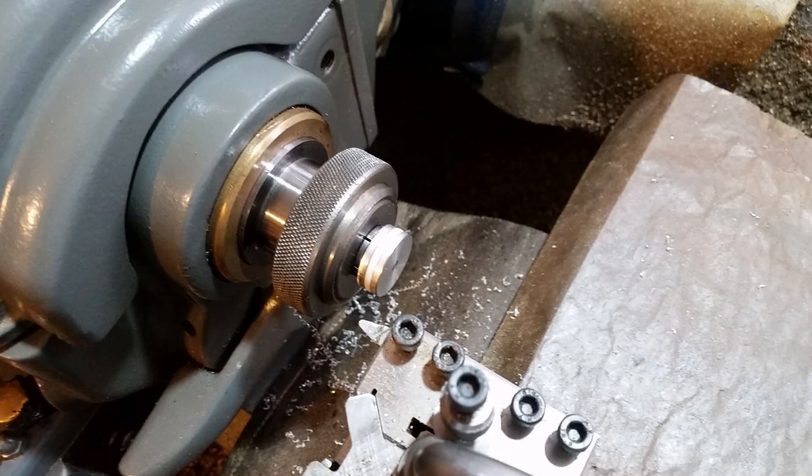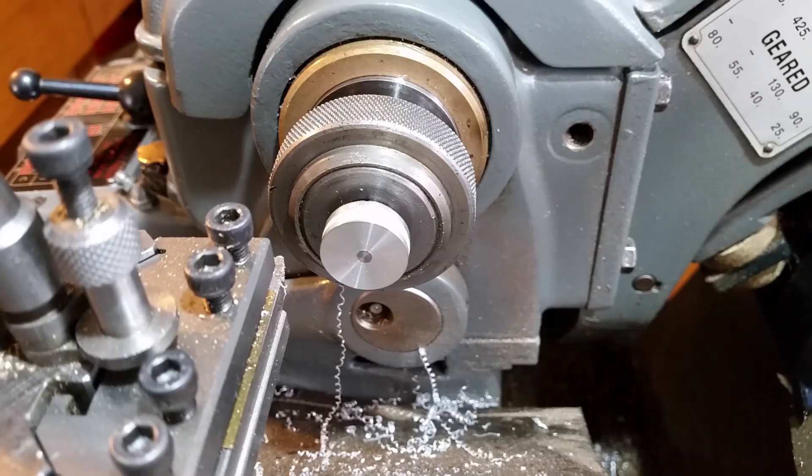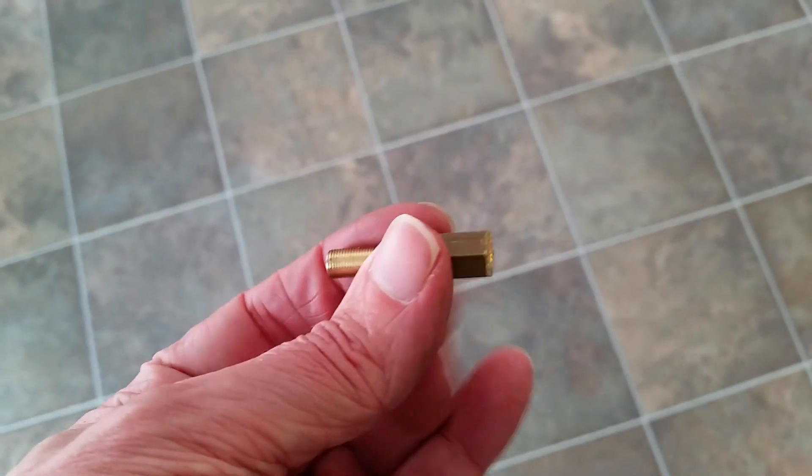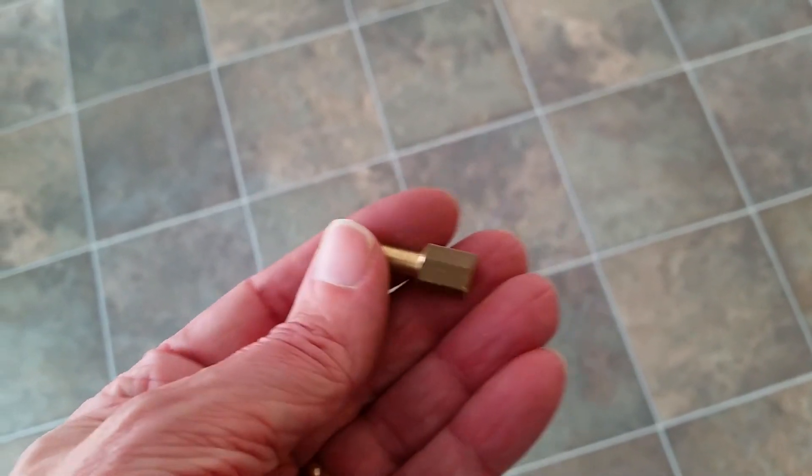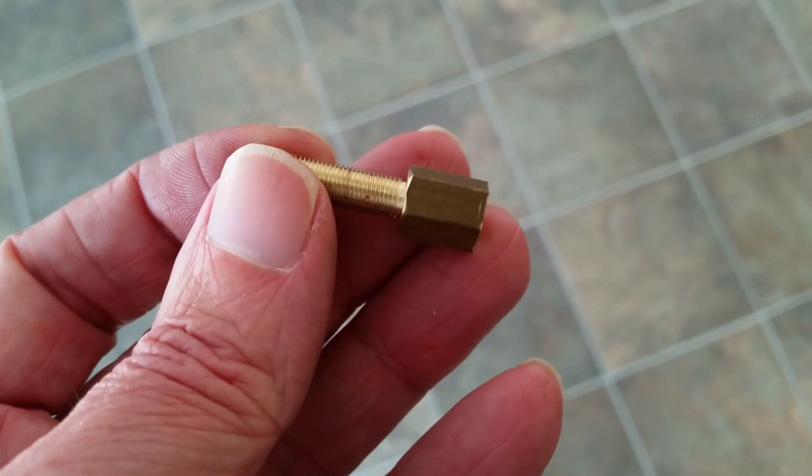The air test revealed improvements needed to be made. The piston was a little too wide at the front — I took 10 thou off with a round nose tool. As I've got the compound slide of the Myford set to turn parallel so nicely, I decided to press right on with the exhaust manifold before doing any milling.